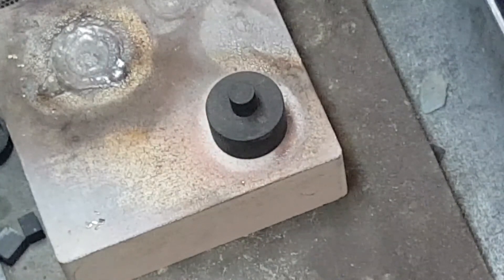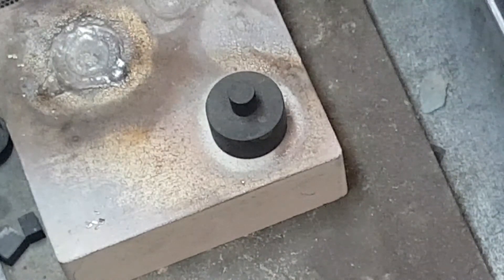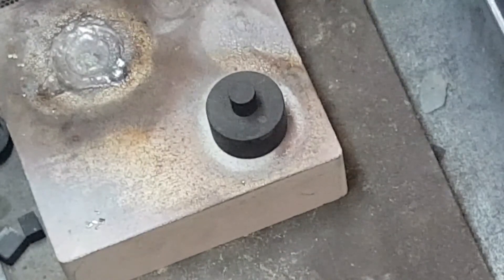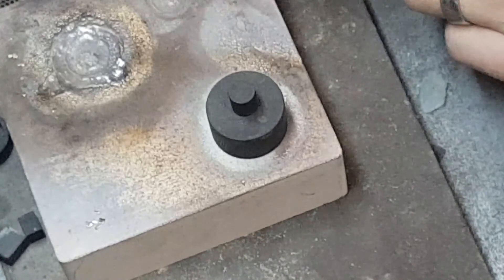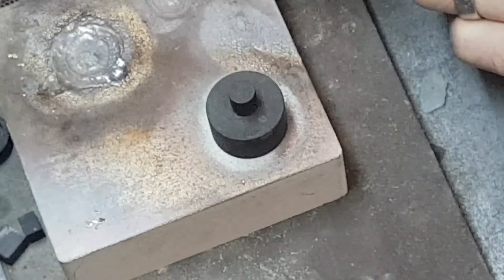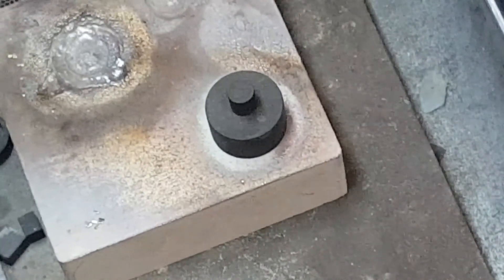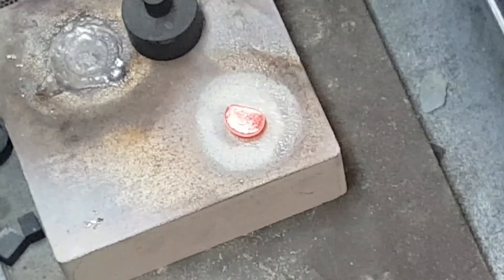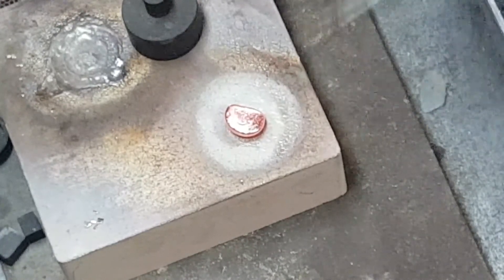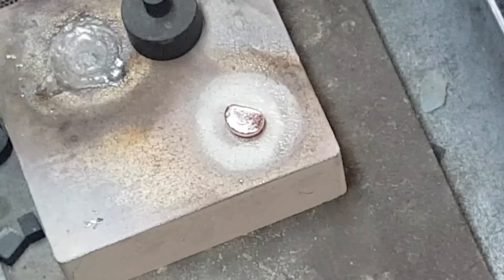What I might do from here is make a part two on this video, because to go from a blob form to a bar — which is the way I do these things — I don't put it in a little ingot like with most other metals. For platinum, I find it better to actually hammer the metal into a bar from a blob and roll it out from there. There's the bar — it's been capped. So if you're doing halo or plate work, that's good to go — you just roll that through the rollers. After it's cooled, acid it. And never quench the platinum — I just don't see any purpose in it.